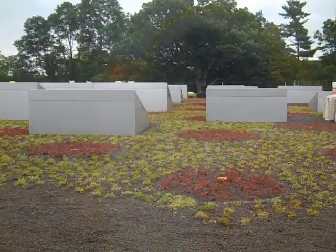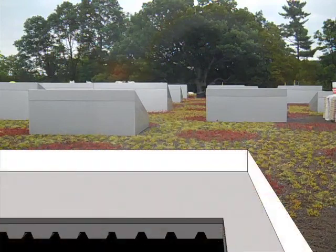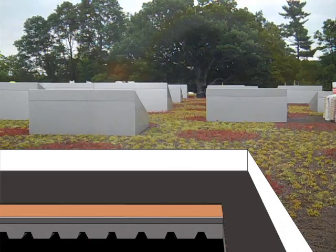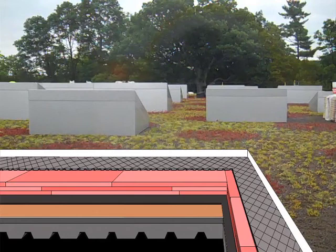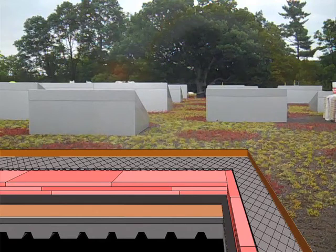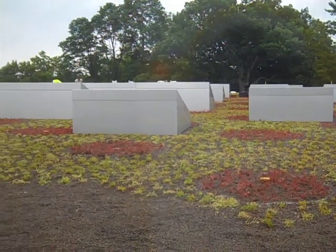Let's review the essential elements of a green roof from bottom to top. First is the structural substrate, in this case a concrete deck with a topping slab. Next is the waterproof roof membrane. On top of that is some sort of protection barrier. Then rigid insulation, here extruded polystyrene or XPS, that can be exposed to water. After that, a drainage layer to capture and direct water to the roof drains or gutters. And finally the growing medium and the plantings — in this case, two types of sedums.